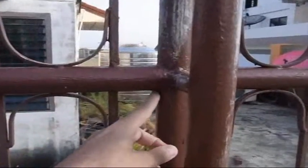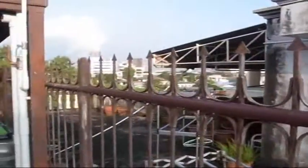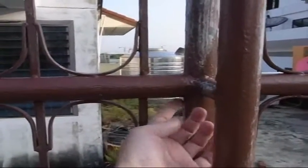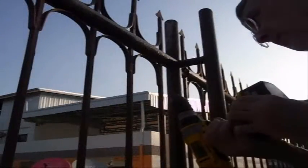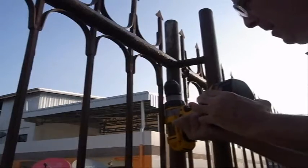So you're taught in welding class not to weld into a closed off pipe like this horizontal piece right here. It's just welded on each end and it's closed off. And so I'm going to drill some holes in here to release any pressure while I'm welding. And that's when the surprise happened. So what I was doing was drilling the relief hole on each end like this.